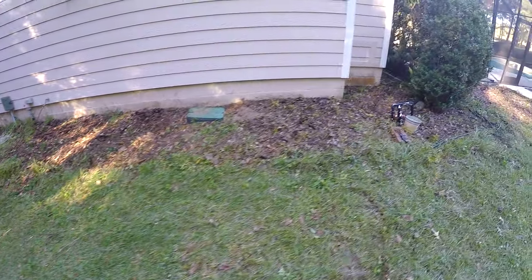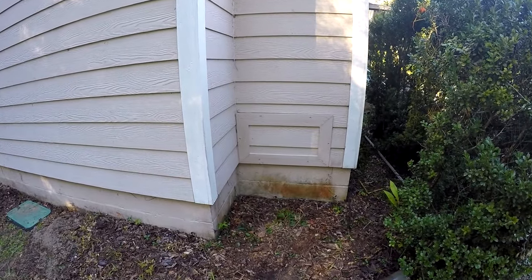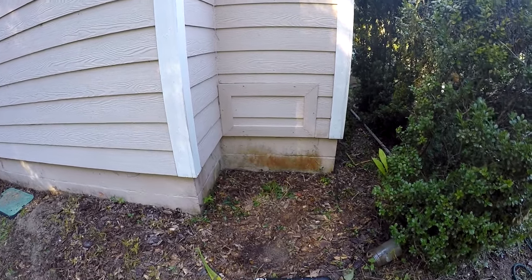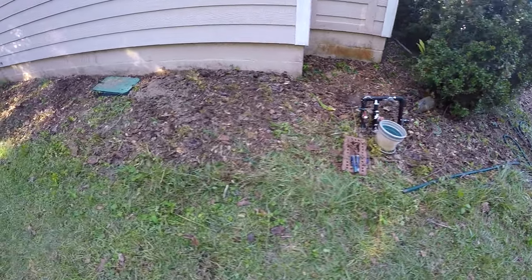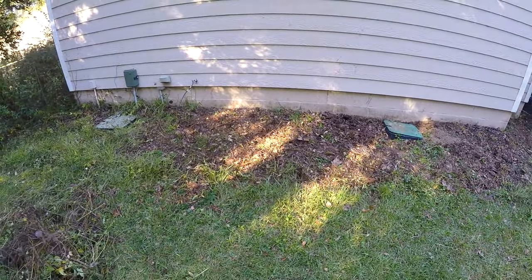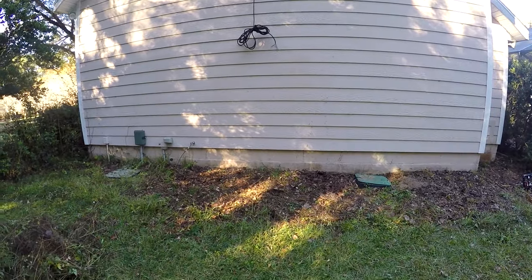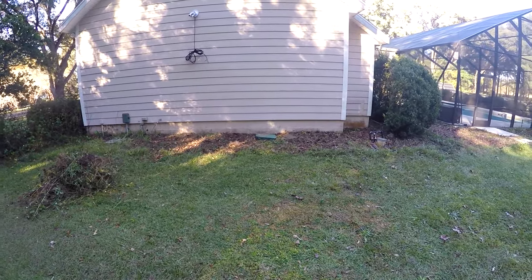And then for power, we used to have a whirlpool tub on the other side of this little access panel. So I've got a 20 amp dedicated circuit that I'm going to pull through there, put a quick disconnect on the wall, mount it there, then drop down with some direct bury wire and conduit, dig this through, try and avoid a million things, get the power over here and hook that up, and we'll put the line set on there with the cover, get that all hooked up, and then we'll be ready to test it out. So I think I'm going to save all that for tomorrow.